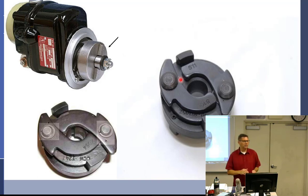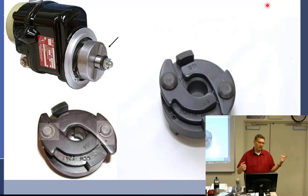Winding it up. So think about when the engine keeps going, the piston is coming up, up, up. It hits top dead center, and then at that point, this right here is going to come around, push on this little ramp, kick that back in, release it from the pin, and it snaps really quick to catch up. So we've done two things. We've made it later and hotter.